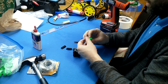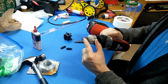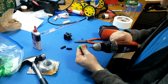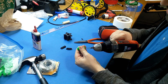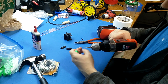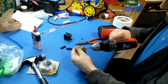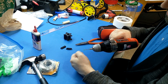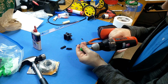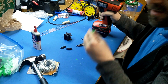I'm gonna grab the roller here. The hole in here is never gonna be perfectly accurate coming off a 3D printer, so we're gonna ream that out. I have a drill here with a 1/16th inch drill bit. We're just gonna carefully start it on the hole here. Pull it out — you want to make sure no plastic stuff stays stuck in there. Flip it around and get the other side. You probably don't want to blindly go all the way through it; that's gonna leave bits of chaff and chunk in there that'll mess with your rolling. Just want to make sure it's nice and clean.